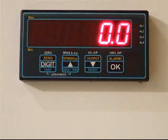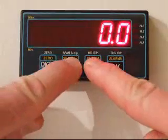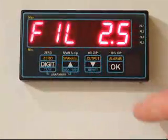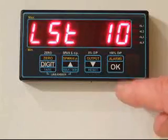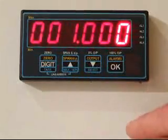It's a very simple feature to get into. You need to make sure firstly that your meter is unlocked, so the calibration lockout switch on the back needs to be off. You need to press the middle two buttons for about three seconds. Filter will come up first. Press the OK button, you'll next see LST, which is the last digit roundup — we don't want to change that. Press the button again, and we now come to our factor.